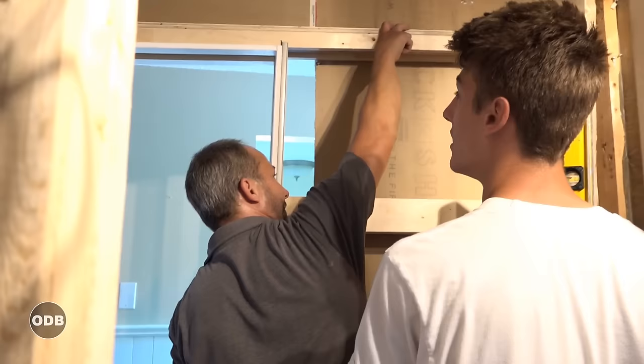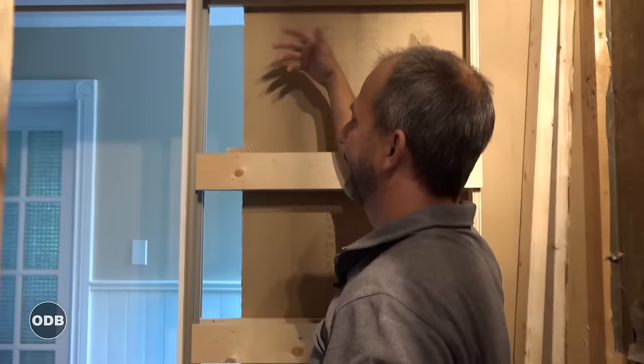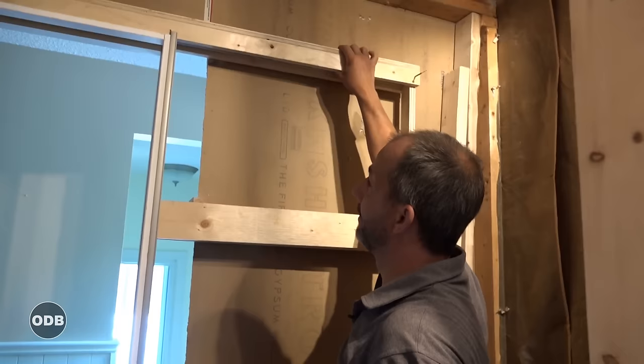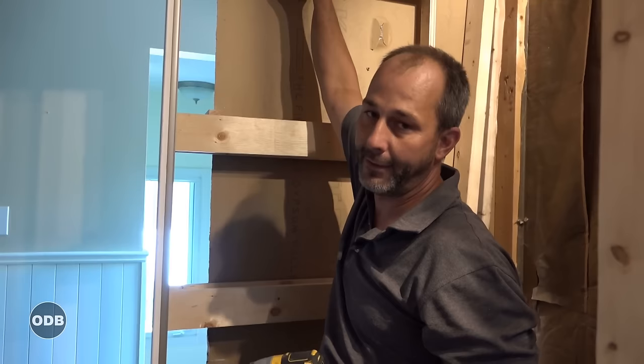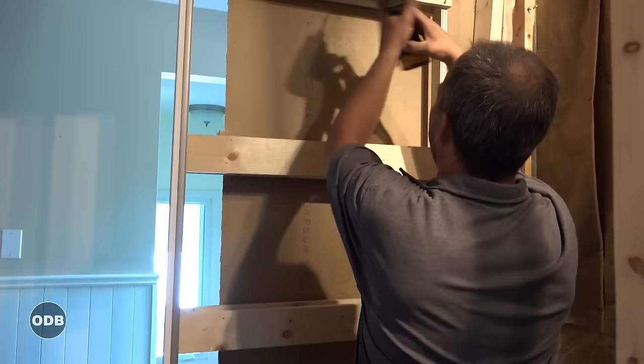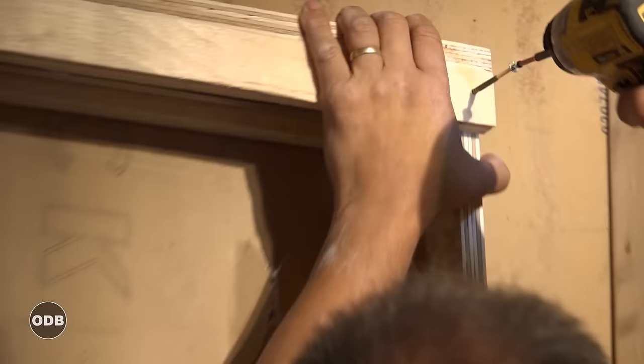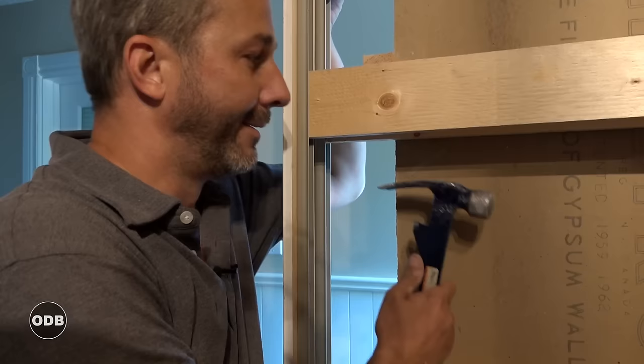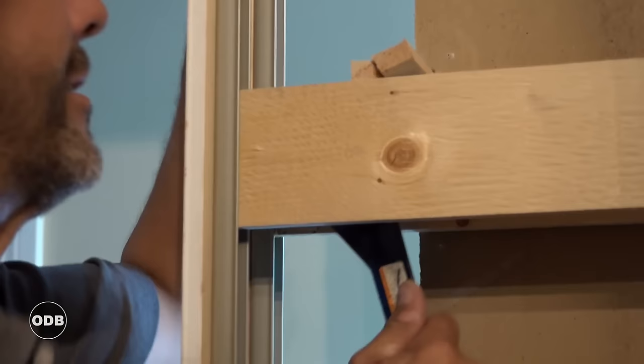The floor is level — incredibly rare in a bathroom on a structural wall. The pocket door comes with a skeleton: a hollow-wall aluminum frame made with plywood so it holds screws really well. The top piece slides into grooves sized for our door. I recommend spending the extra five dollars to buy the right-size frame rather than an adjustable one — it'll make your life simpler. Once level and square, throw in a construction screw and pre-drill to keep the plywood from splitting. Don't forget to remove the little blocks or you'll drive yourself nuts trying to put the door in.